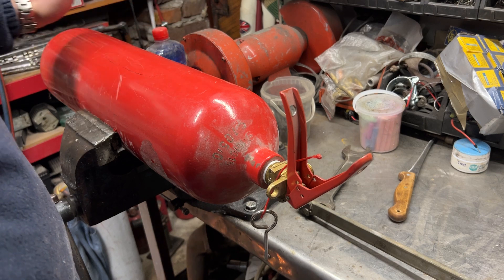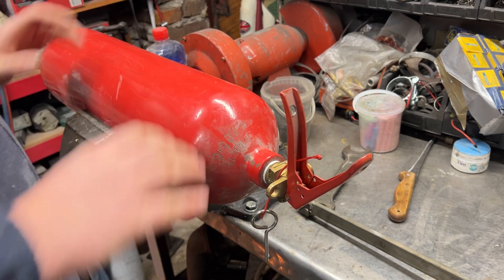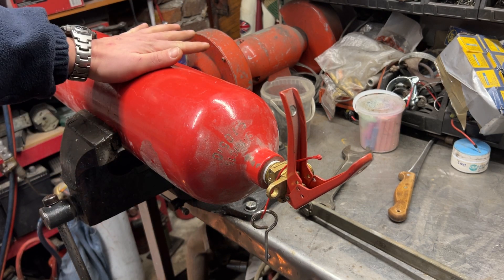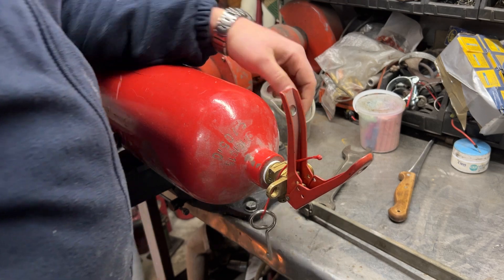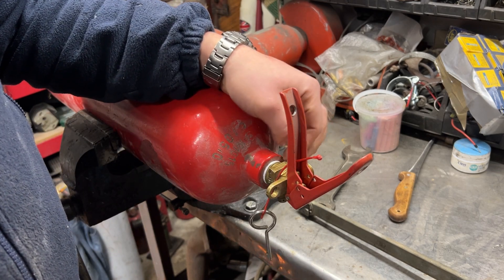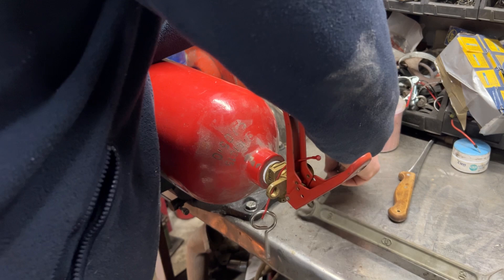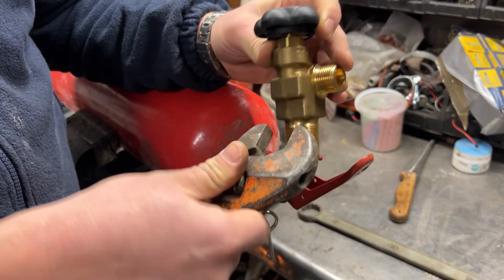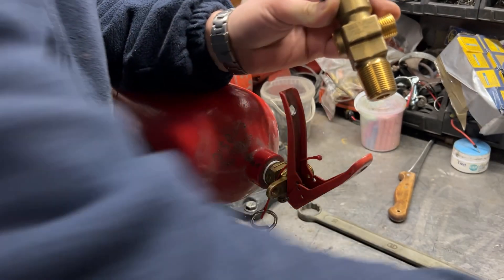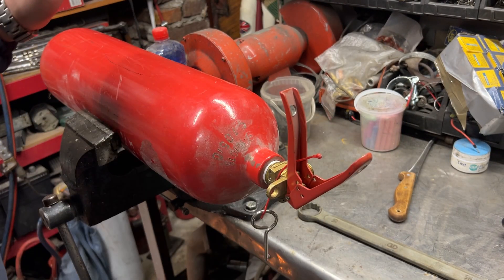Second, it needs to be secure. I'm not in a special facility for changing valves, so I don't have chains or anything — I'm using a big vice. It needs to be tight, because the valve itself is tight. I'll be throwing this old valve in the bin, so I don't care if I damage it. I have exactly a 30mm wrench. You can also use an adjustable spanner — I've done it before with a pair of vice grips, which just leaves marks. No pressure inside, nice tight fit.